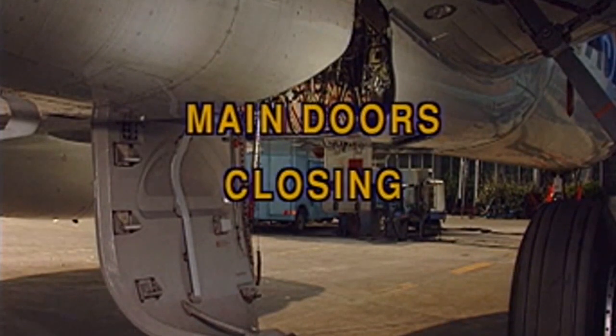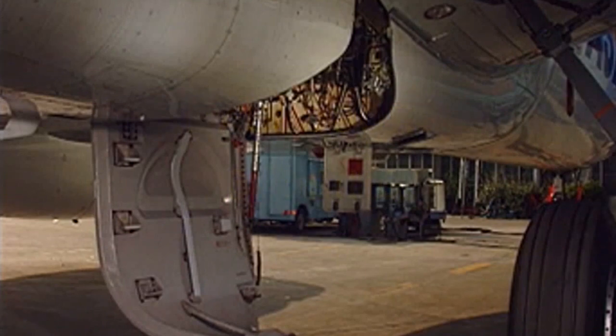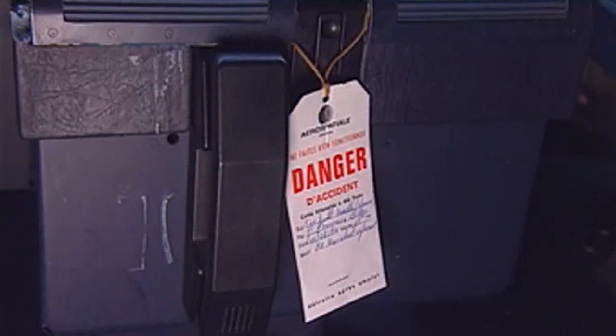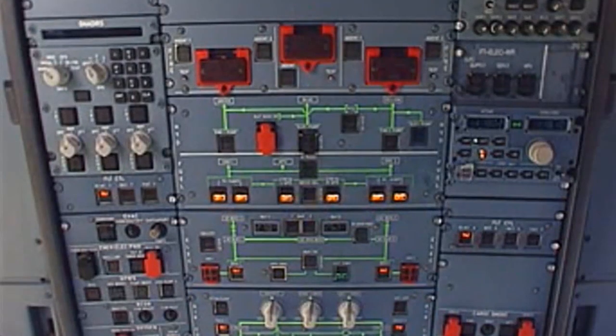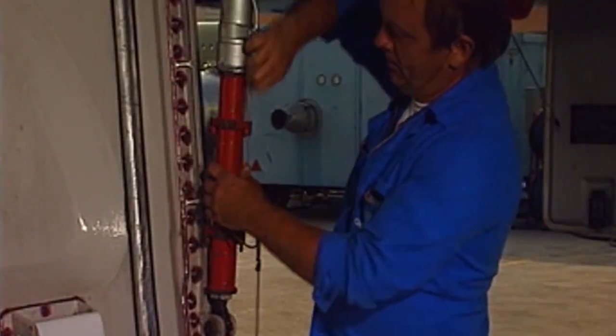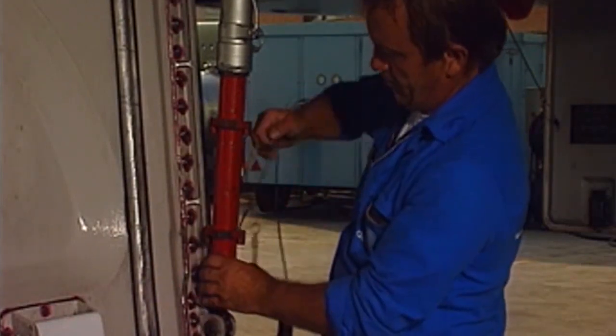After servicing, the door can be closed. Here are the precautions that have to be taken. In the cockpit: landing gear control lever down with the warning notice in position; landing gear free fall crank handle in the normal position, folded, and a warning notice in position; green hydraulic system depressurized. On the ground, make certain that the ground door opening control handle is locked in the open position.